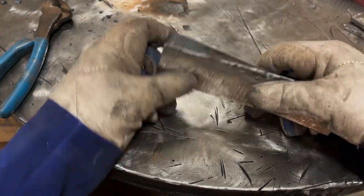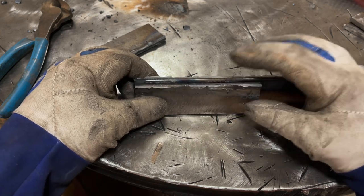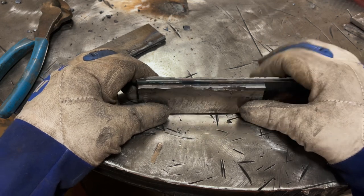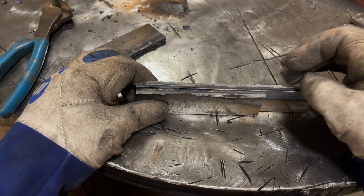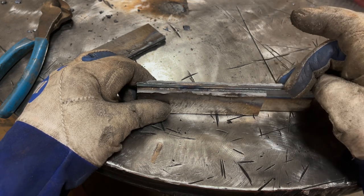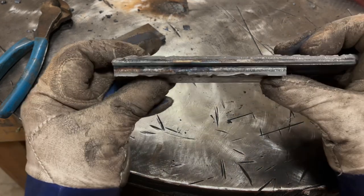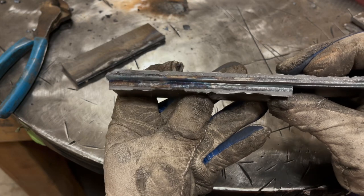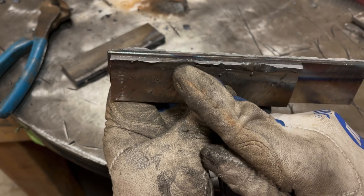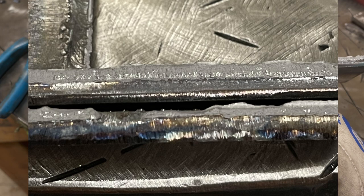So we had a little bit different results with that, where much higher amperage, much more consistent weld end to end, took massively more force. The other one almost took no force to break. And now we did have more weld on this, so I guess it's really not an apples to apples comparison, but trust me, even if I had nipped the plates off, this thing would have held way more weight. And the reason is simple. When you look at this, and you look down here where the bare edge of the plate's exposed, there's no strength there because, well, there's no weld.